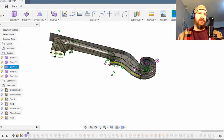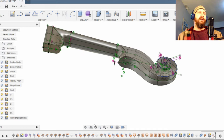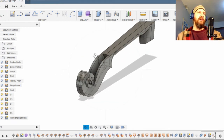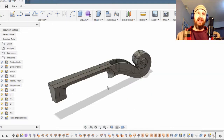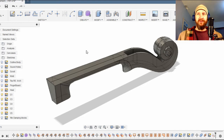From this point it's the same thing we did for the top - just trimming out edges and trying to create a solid, watertight form. You finish the form, bring it all into patch, and start patching them together. I'll fast-forward to the end and that's what we get. For the pegbox, I created a shape based off this contour, extruded it down, and used the combine tool to cut it out. That's the neck - we'll probably cut a test piece to figure out the fixturing we'll need.